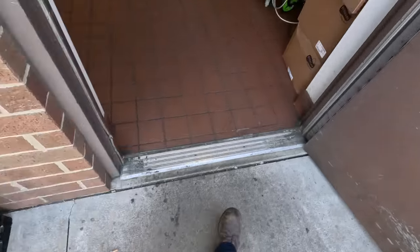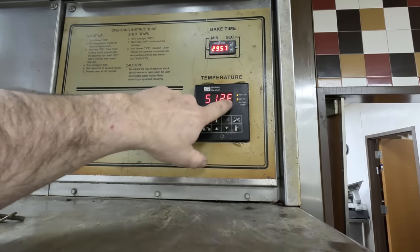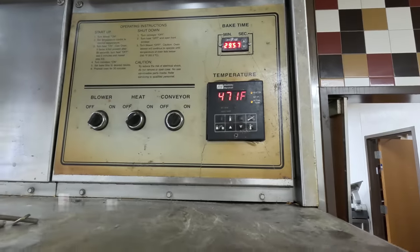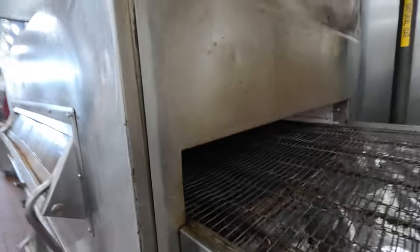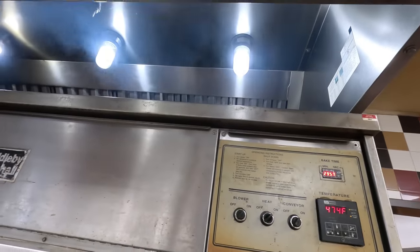At least it's got some pizza in it. This one here — 512 is the set point. Actual temp, 470. What it does, it hits 512-ish and then shuts down. All these are furnaces that cook pizza. The building's being pulled into a negative, but I don't think that's what's causing it.